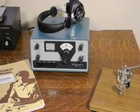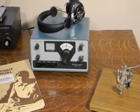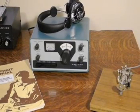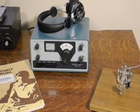The HW8 was very popular. Its main advantages were its small size and suitability for portable operation. It's easy to operate, VFO controlled, and offers multiple band coverage. It's quite sensitive and stable. The main limitations are that the transmit and receive frequencies have a fixed offset, there's no S meter, no automatic gain control or noise limiter, and the output power is not adjustable and is a little on the low side. There's no speaker and no dial or meter lighting — although this saves battery power. It's also lacking support for some bands and has no crystal calibrator. Many of these limitations are addressed by the various modifications published for the radio. Some people have claimed the HW8 is the most modified rig in ham radio history. The HW8 Handbook is a book of HW8 modifications and articles that went through four editions — it also covers the HW7 and HW9, and you can still purchase an electronic version.